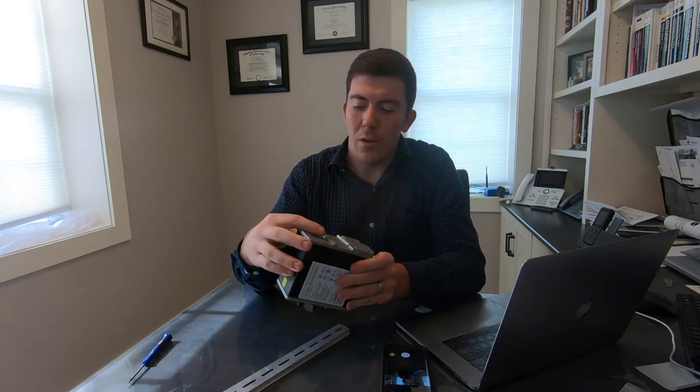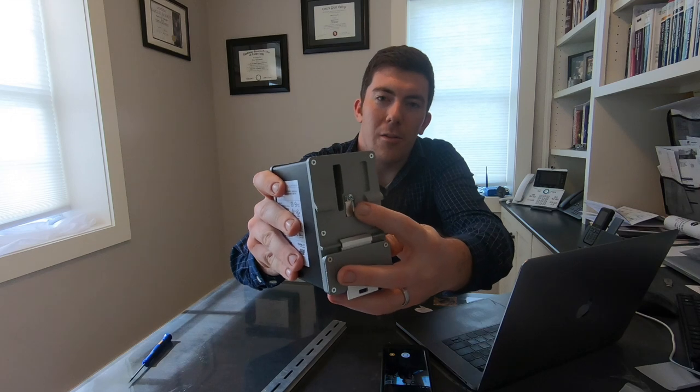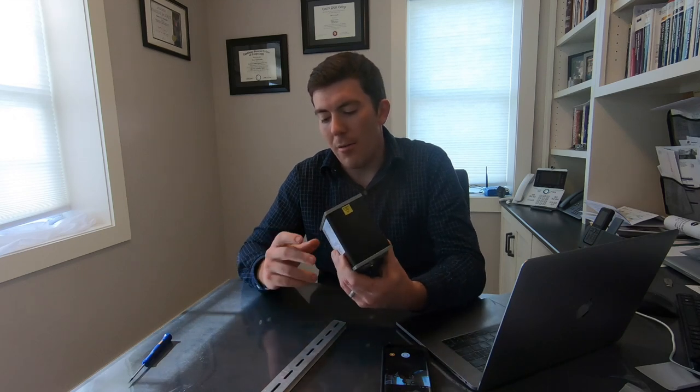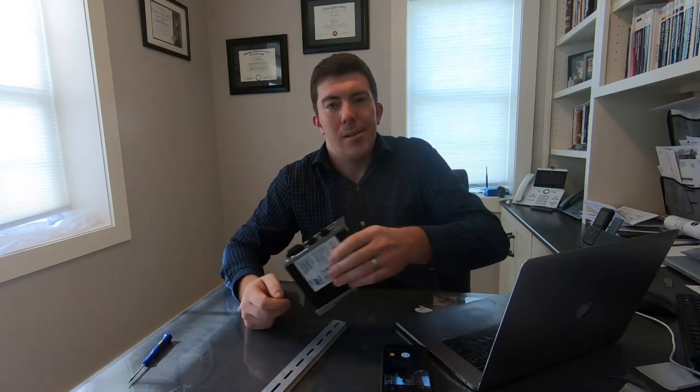There are a couple of reasons why we use this. Because the DIN rail is mounted to the panel, which is grounded, the switch has a little tab that ensures pressure against the DIN rail so that it is also grounded. Of course, that doesn't mean you shouldn't also be using the grounding tab on the front — it just gives you another ground for electrical safety.